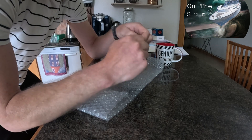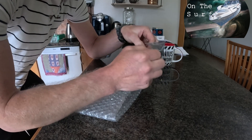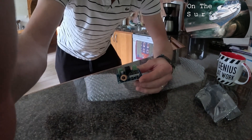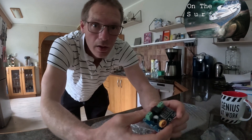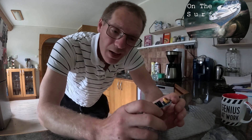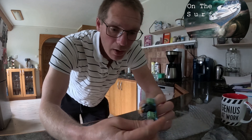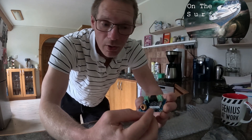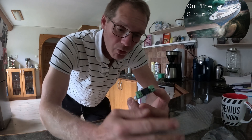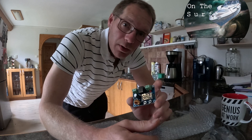This is probably gonna fix all my controller problems with the water boiler. It's a really simple thing — it's sold as a low voltage protection device. You just connect positive and negative in and positive and negative out. On this display you see the actual voltage, and with these two buttons you can set the voltage for when it's gonna turn on and turn off. I'm gonna hook this in series after the MPPT and hopefully it works as I want.